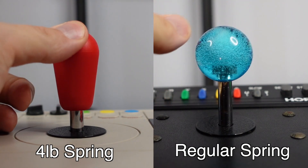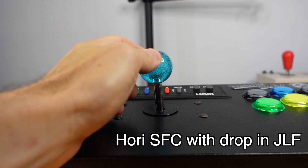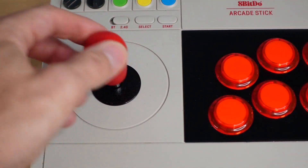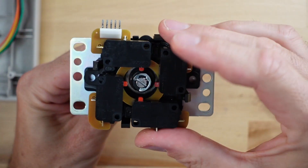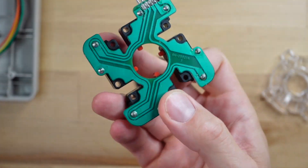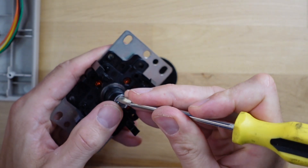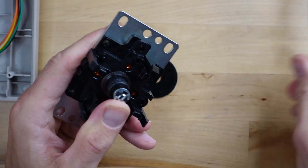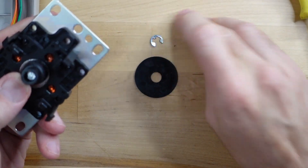The next small mod you can make is to change the spring inside of your stick. It's what controls how hard it is to physically move the stick from left to right, up to down. A standard JLF is fairly loose — not too hard to move. But I found when I was first learning Dodonpachi that it was too loose; I couldn't quite control myself through the tight bullet hell patterns. I moved to a stiffer spring and it was a little bit easier to learn the game and those extremely precise movements. To get to your stick's spring, first take off the restrictor plate, then pull out the micro-switches from the PCB. The hardest part for me is usually getting the E-clip off — that little thing that holds the actuator down. You've got to put your finger over it to make sure the clip doesn't fly across the room, and make sure the actuator doesn't fly across the room either.